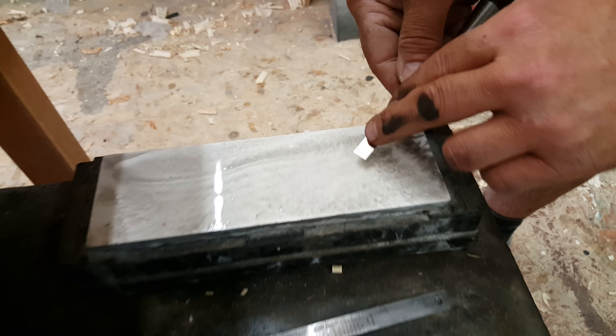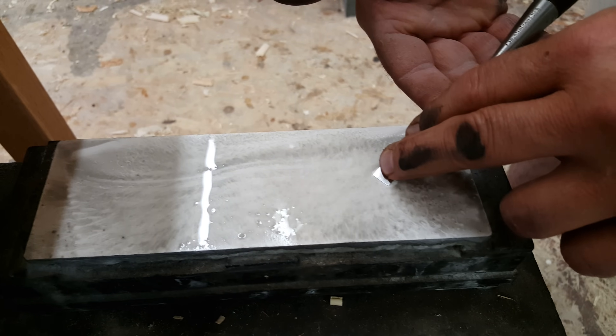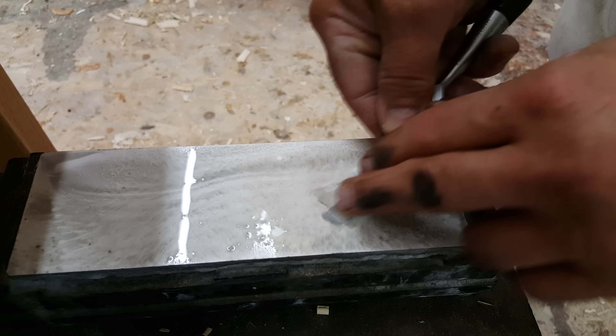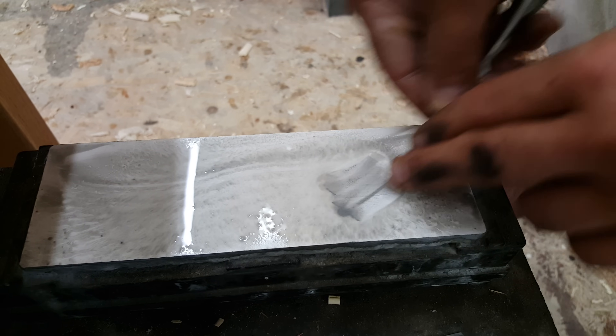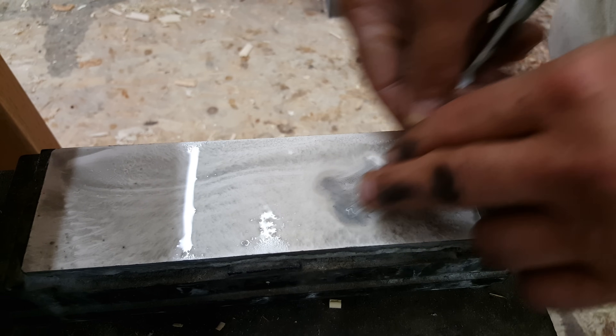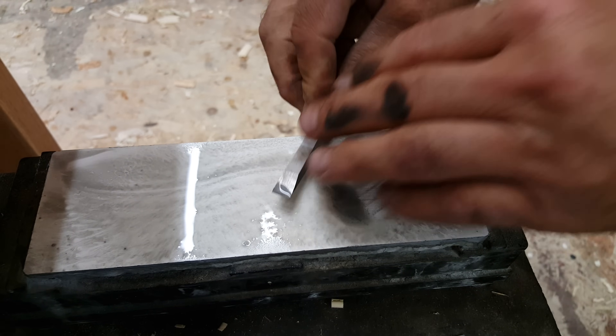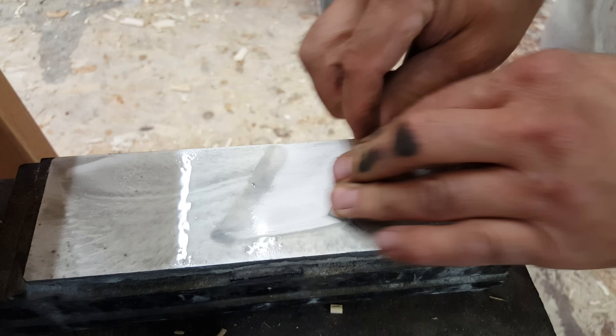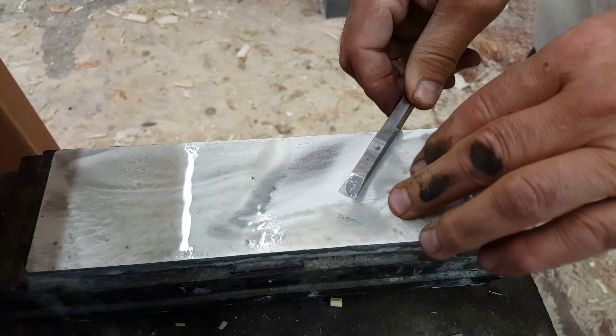I want to be able to feel a little bit of a burr on the backside. Light to moderate pressure, with hands tied together so it's easy to freehand and keep the angle consistent. Now I can feel a little bit of a burr on the backside, so I'm going to switch to my 16,000. Find the primary bevel, raise up just a little bit higher — if I went up one degree on the previous stone, I'm up maybe two degrees here. About five seconds of work just to polish a leading edge, what we'd call a tertiary bevel. Then lay the chisel on its back and just a couple of seconds to get rid of any burr.